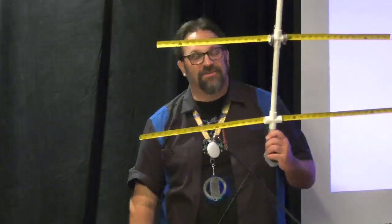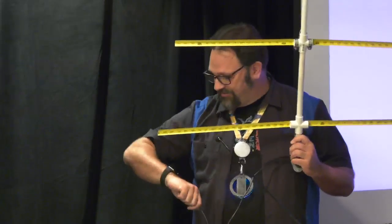So I have a directional antenna. I can point at things and figure out which direction this signal is the strongest. I have an attenuator that I can use to vary the signal strength however I want, pretty much continuously. And I have my signal moved from the main frequency off to a different frequency so that the transmitter doesn't get into the body of the radio and overload the receiver, in the sense of it's always full quieting. I don't have that problem anymore. So those are the three things that this antenna accomplishes. And I would love to do a demonstration.